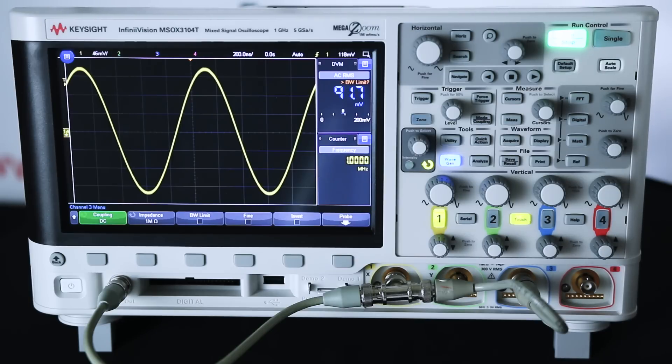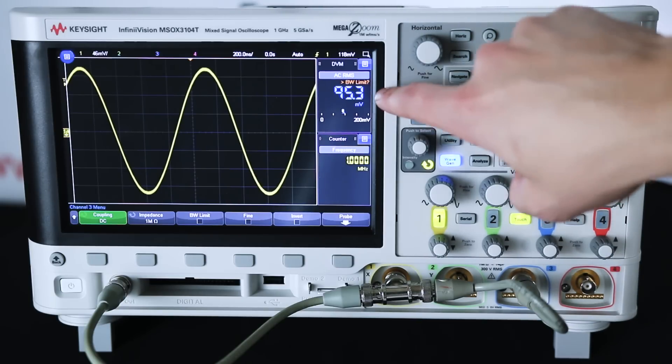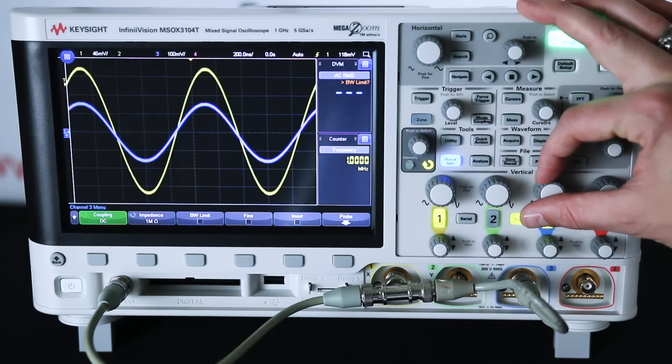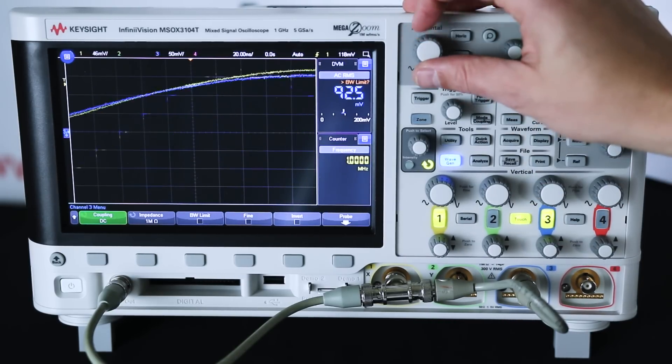So it's not going to be a full replacement for a handheld. But for example, if you had two different signals on your board that you were probing, and you only wanted to see one of them on screen, but you still wanted to make sure that your second channel — in this case, channel three — is functioning the way you expect, instead of having to hook up a DMM, you can just still use your probes. And if you do see something weird on channel one that indicates a problem on channel three, you can turn on channel three and play with that however you want.